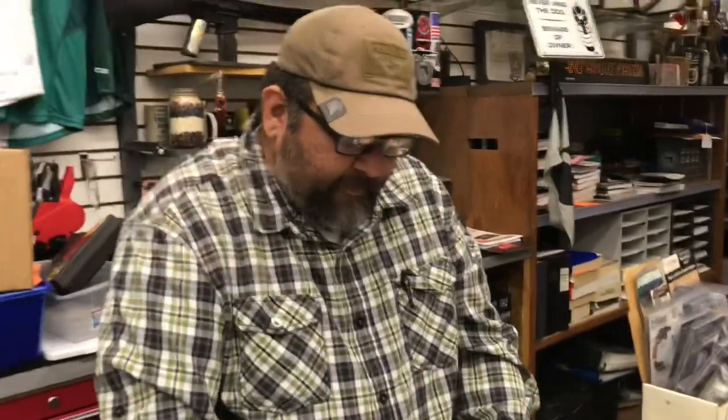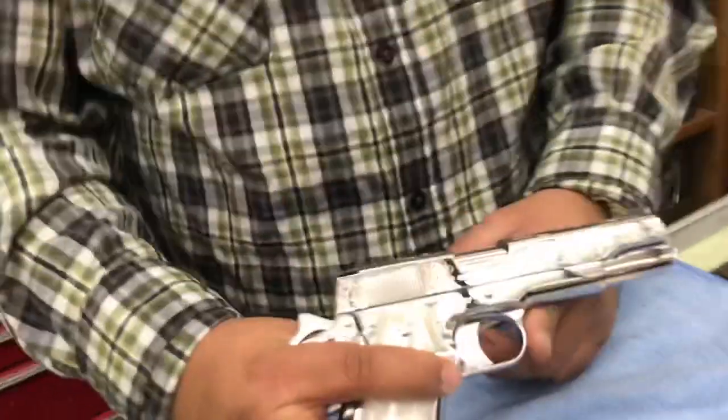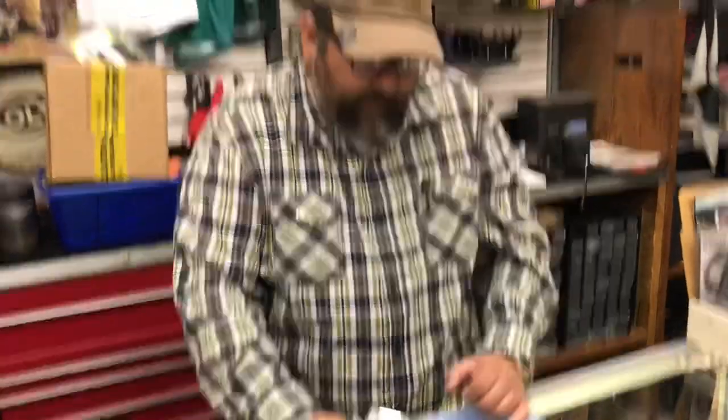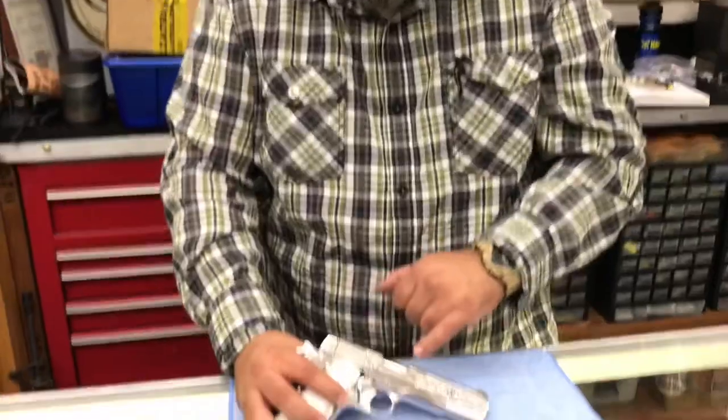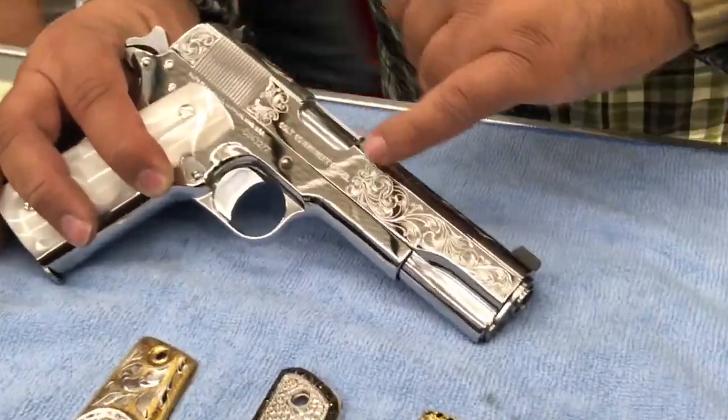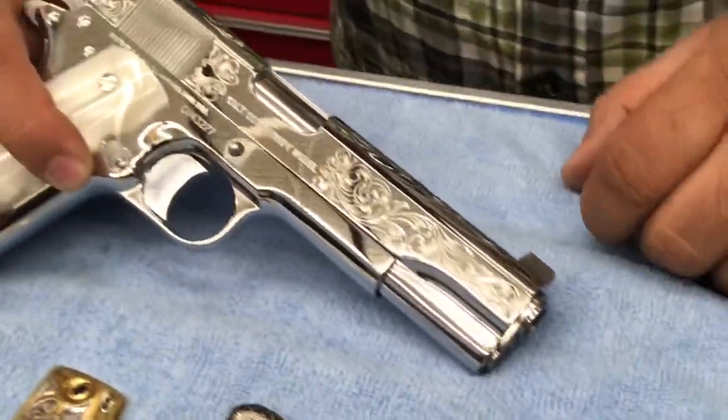How long did it take to get to that polish? A couple of days. A couple of days of polishing? Yeah, that's not nickel plated — it's all hand polished. You've got to take any blemishes off from the standard finish, go through a few different grits of sandpaper up to about 2000 grit, then finish on the machine to get that real good shine. And you have to be careful not to lose any of the detail — the original stamping, the curvature, or the hard lines on the pistol.